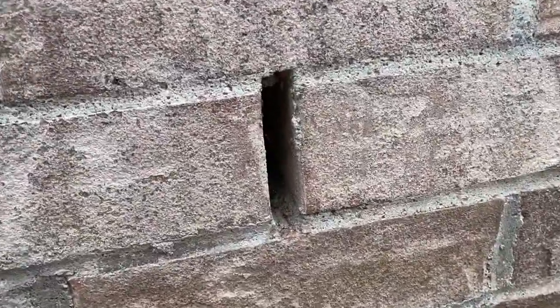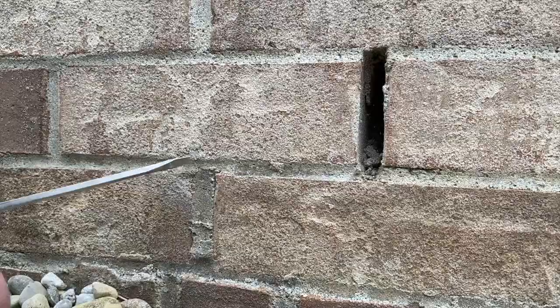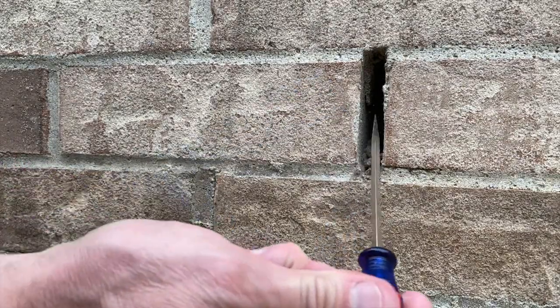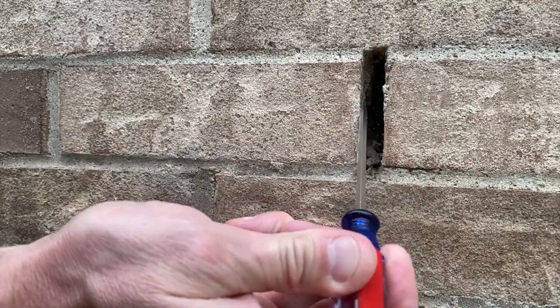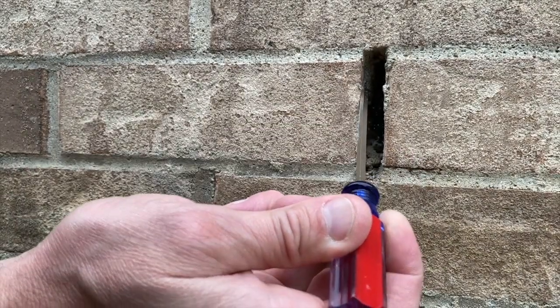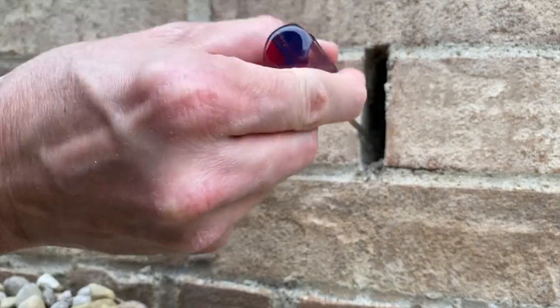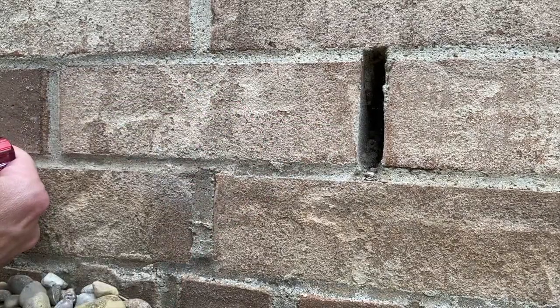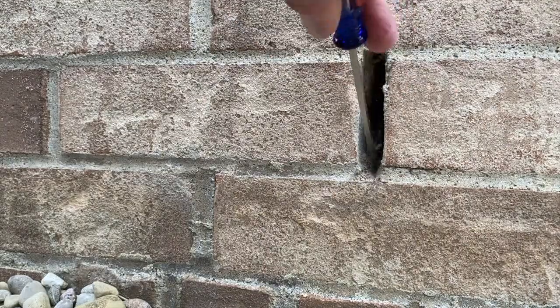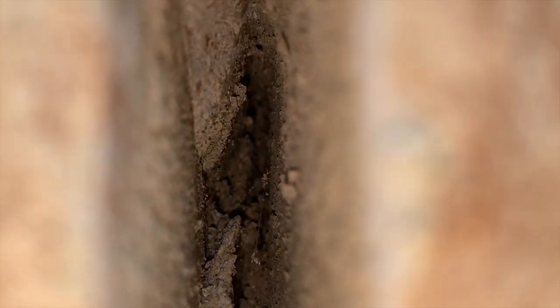Taking a step back, let's go to the opposite side wall. Inside here, you can see basically a bit of mortar buildup, and that will make it very tough for us to get those screens inside in a friendly manner. So I'm going to show you what you can do to remove that internal mortar. Grab yourself a very thin flathead screwdriver, insert it in, and basically begin breaking away that mortar. As you can see, it's breaking away very easily. For certain areas, you can tap the face of the screwdriver with a rubber mallet to give you better jolting power to break away that internal mortar — to clear up this weep hole and allow you to install the brand new screen in a much friendlier manner. Coming back to a view after I broke away several bits of mortar, to again allow us to easily slide that brand new screen in place.